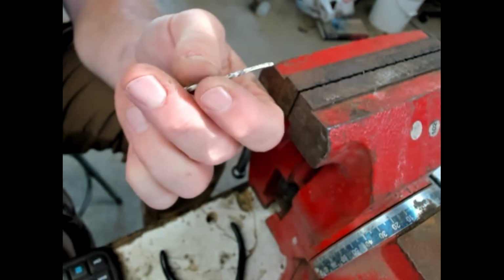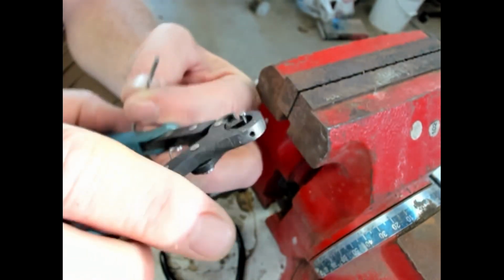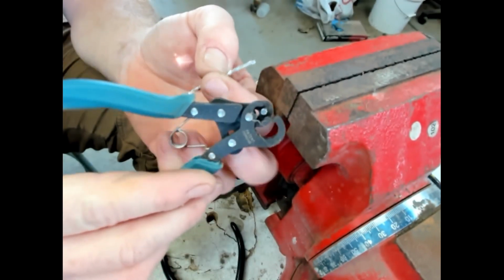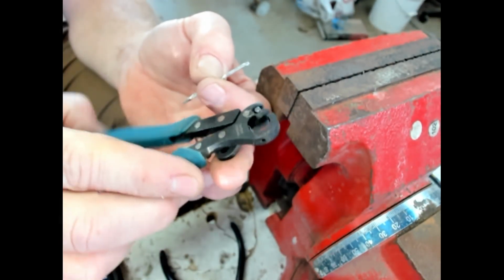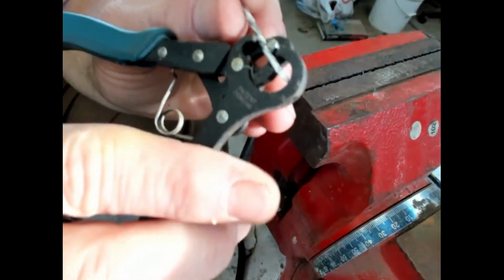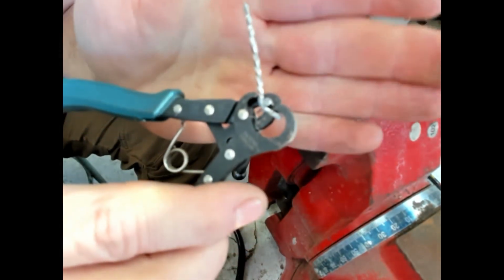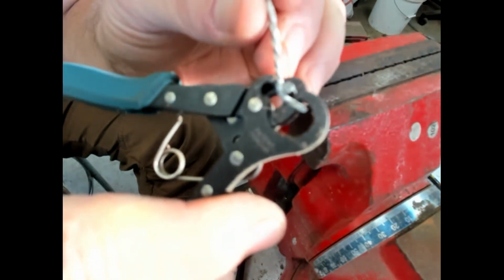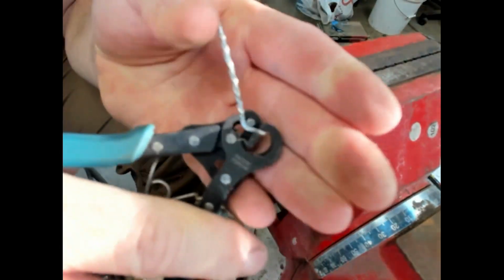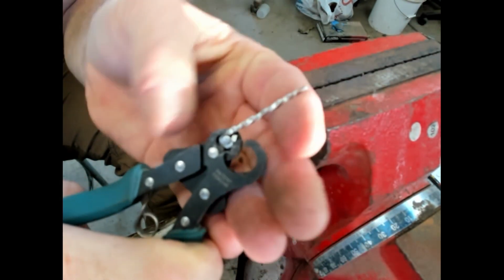But what we can do, rather than using those round pliers like before, here's a really cool set of pliers, and I'll try to find all the links where I got these different tools and put them below in the description. But this will automatically form and trim a loop for you. So you just set it in here. Make sure I get a good. So you see there, it's bending. Come on, camera. There, we almost had it. Okay, so we're bending and cutting at the same time, forming that loop.